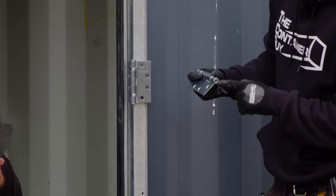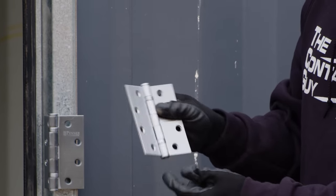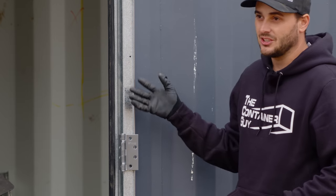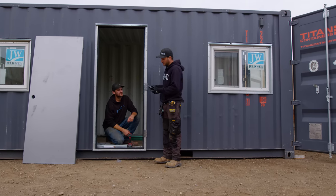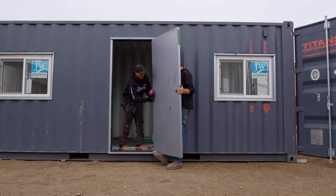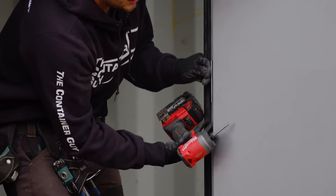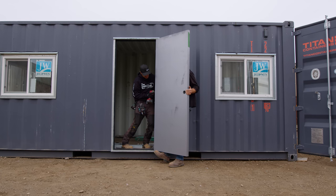With these hinges, there's an open side and a closed side. The open one is the bottom, so you don't want rain or ice getting in there — that's typically the bottom. A lot of times with these frames, just be aware they may ship with hinges already installed for a right-hand swing door. If you are doing a left-hand swing, rotate the hinges. We get the doors so that they're just single-prepped, so we can rotate the door one way or the other — there's only the ability to accept the hinge on one side of the door. I don't think there are many door frames on the planet that are truly reversible like this.